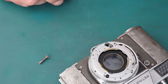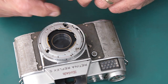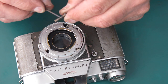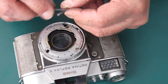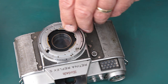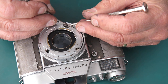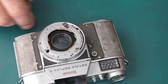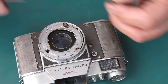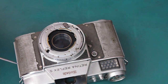That needs to go in. Now this will couple to the front control rings of the camera and it couples to the meter drum. I'm just running some molybdenum paste on this — you could lubricate this shaft just as well with synthetic grease or anything else you happen to have. It was vaguely greasy. I've got to get that to drop into the slot and it did — it just about fell in. I used to always fight with those; I'm not sure what I was doing wrong. A little pinion here — I'm running some grease through there.